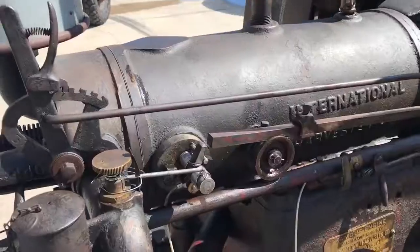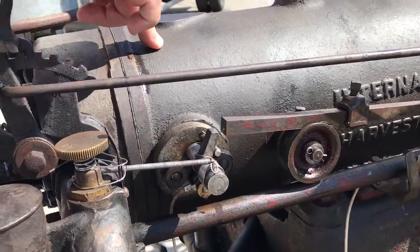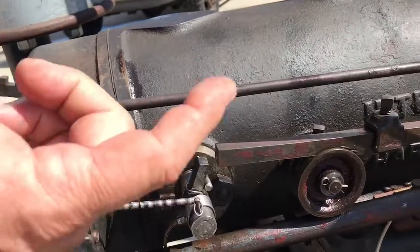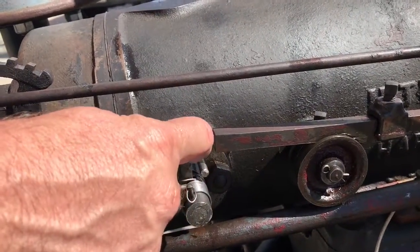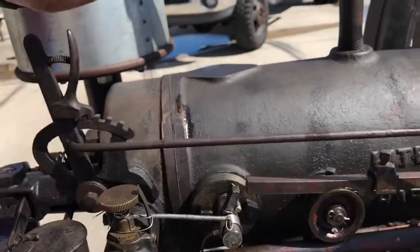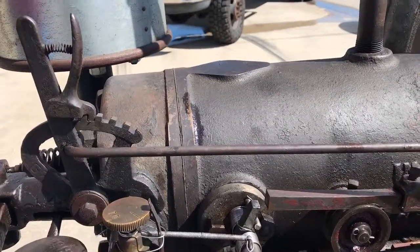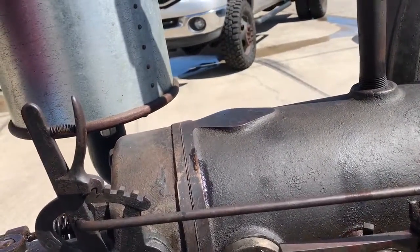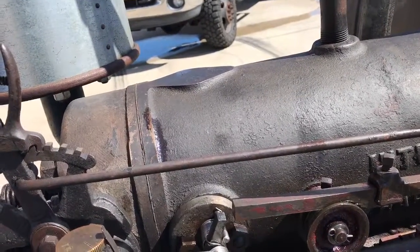And then the igniter is just, what is it? Basically, you've got points inside the combustion chamber. As this closes those points, they start charging up with a charge of electricity, and when it snaps back open, those points fire, and that's your ignition source. Really? How hard is it to get in there to change those? It's not bad. Just take these 2 bolts out, and the whole igniter pulls out of its assembly.